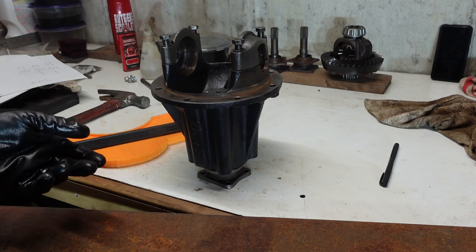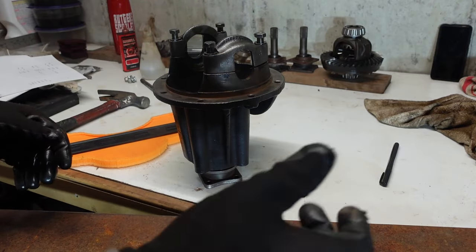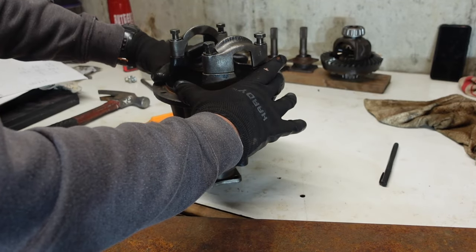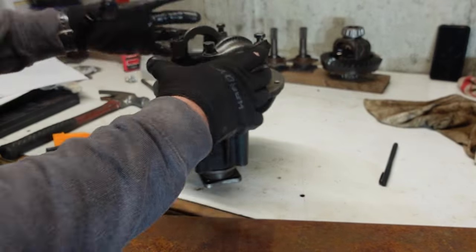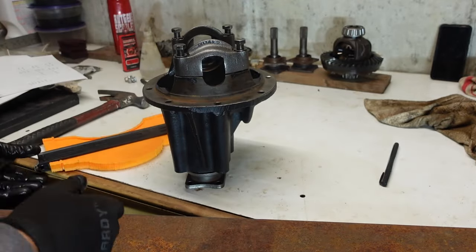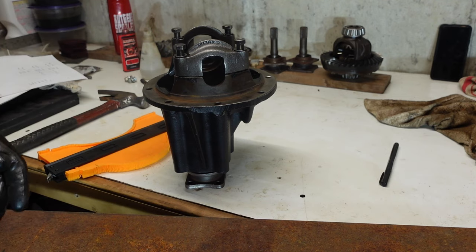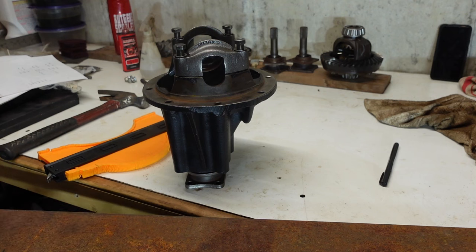The object here is to make a case spreader as close to what I can find in the workshop manual. I've got a big piece of quarter-inch plate from a scrap yard for literally three dollars. I'm going to make a plate on either side that's going to fit down and bolt to the case, and then we'll have a threaded rod in between. The threaded rod will separate the two pieces — just like the workshop manual shows — with two nuts run out to slowly pull the case apart. The first thing I've got to do is get the contour here where the bearings go, transfer that to the quarter-inch plate, and start cutting it out.